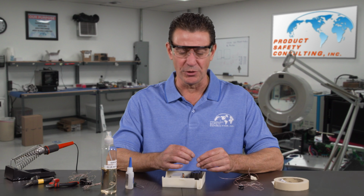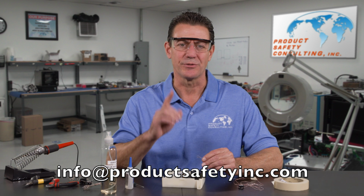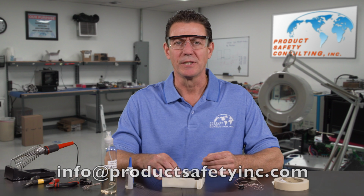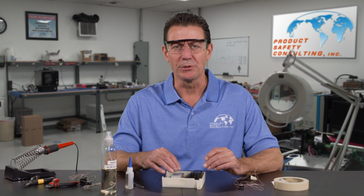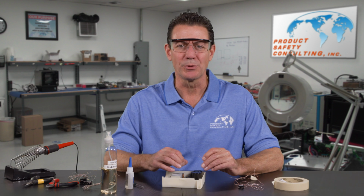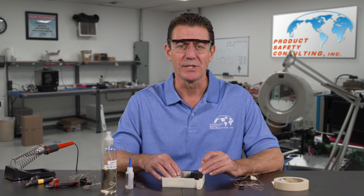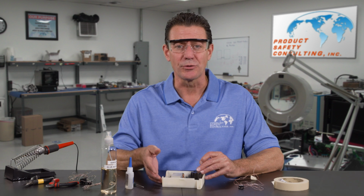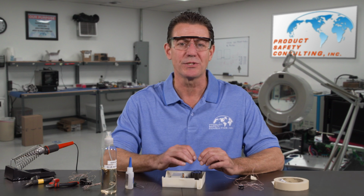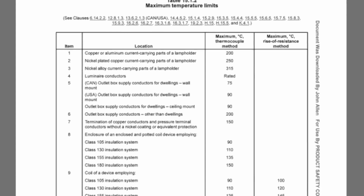This video is going to show you how and where to place thermocouples to be in compliance with most certification standards. Make sure you read the standard before you proceed. There's all kinds of tables for temperature data, but in general, you're going to be putting the thermocouples in heat-generating components, wires, connectors, terminal blocks, inner walls of polymeric materials, on circuit boards underneath hot resistors, external surfaces, external supporting surfaces. Like I said, most standards have a table, a list of components, that we will show you as a reference of the minimum components they require thermocouples on.